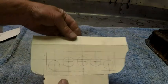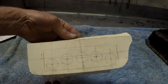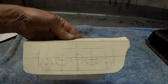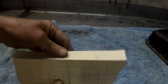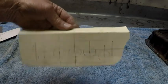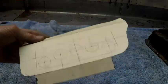Then you develop up a full baffle just using vanilla folder type card and you can lay out all your holes and the little flaps, and that will fit inside the sump so you know it's going to work correctly. It's so much easier to make it out of cardboard first than to go ahead and make one out of metal and find it's wrong.